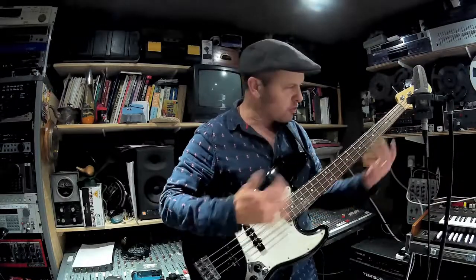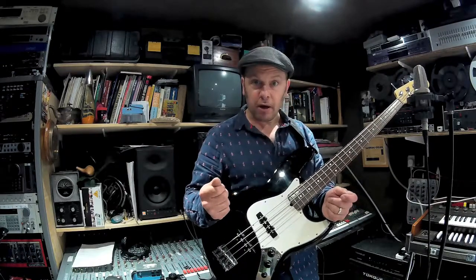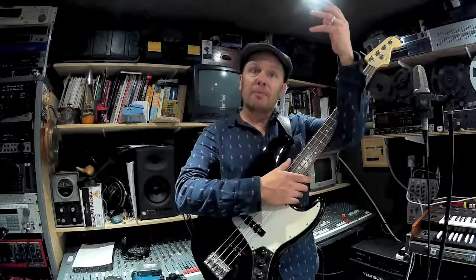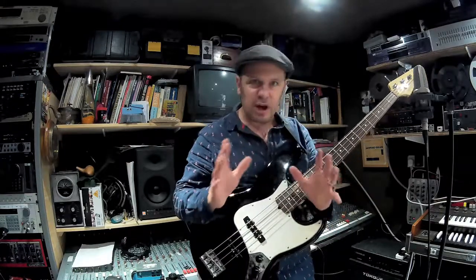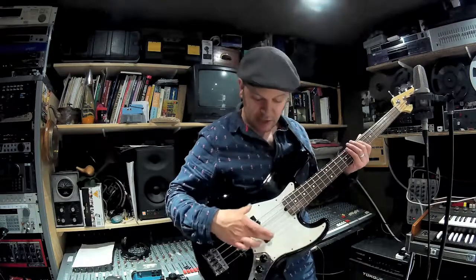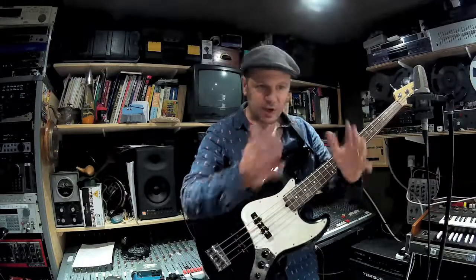I've tried to play roughly the same volume level with the same amount of slap — it's easier to demonstrate with slap because it's more top end. It's a bit like if you have a big eight-inch shower head in your bathroom being fed from a small gravity tank in your roof — it's not going to work, just going to trickle out. Two solutions: either you put mains water into your shower, or you put a smaller shower head on. You're matching the pressure from the tank to your shower head — we call it impedance matching with audio electronics. So you heard much more treble, because the line input was the big shower head and it sucked too much pressure out of your pickup. I put a smaller shower head on with the DI box and suddenly had all my pressure and full fidelity — that's what I've done.